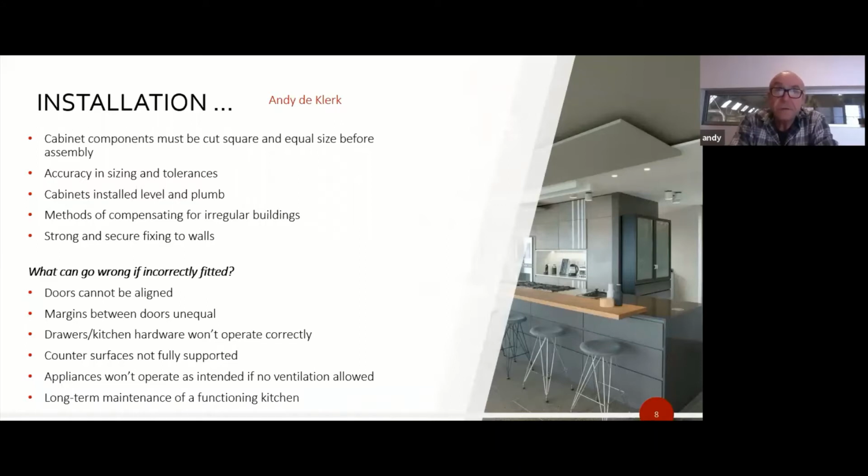When you first start out, the thing you need to do on an installation is to determine the high points and what's out. So in addition to having your setting out point, you should figure out where the high spot is, and you start there and work out. And if a wall is badly out of plumb, you start with the furthermost out point and start there.